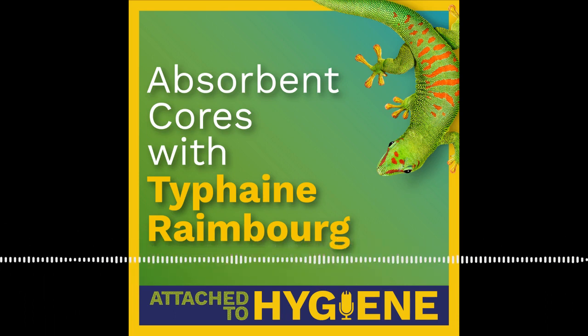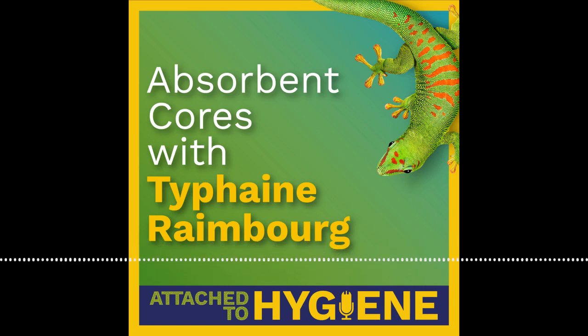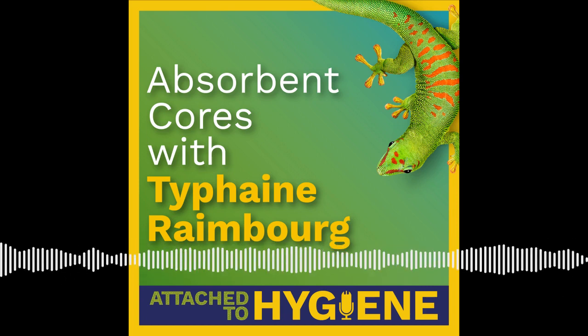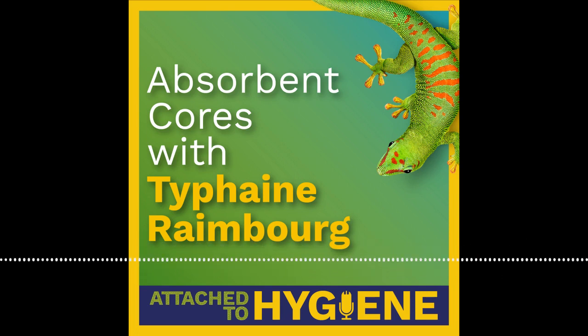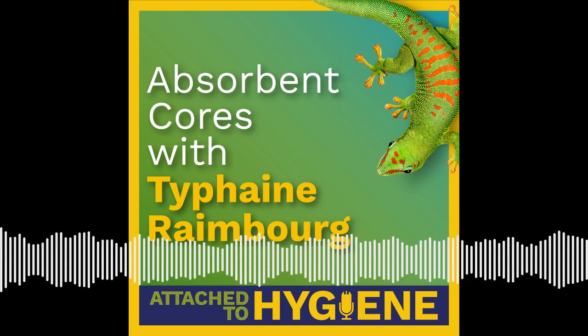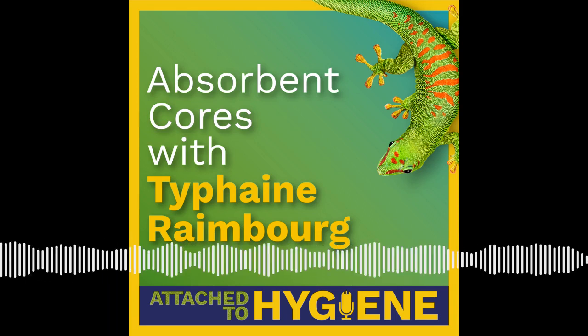If you remove all the fluff, you need an alternative system to hold the SAP in place, and SAP still needs to do its job. We can see a real evolution in terms of reducing the fluff content to have a thinner and thinner core. When the fluff-to-SAP ratio decreases and you have more or only SAP, that impacts the absorption speed — not necessarily the capacity, but the speed of absorption, because SAP takes a little longer to absorb any sort of insult than fluff would. So there's a trade-off that has to be made, or other technologies need to be considered in order to speed up the absorption speed of the core.